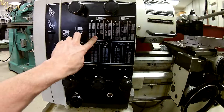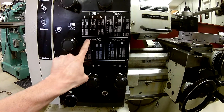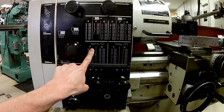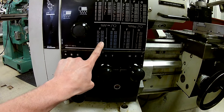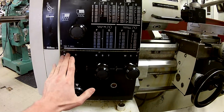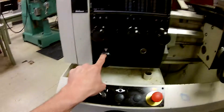Everything we look at on this side should correspond with F for our feed. This part that looks like a screw is for cutting threads — that's later in the class. What I'm looking at here is feed per revolution. I'm looking for 6 thousandths per revolution, so I go down the F column and find 0.006. Next to it I see the code AR4X.